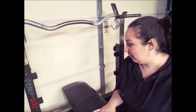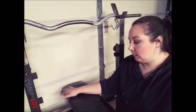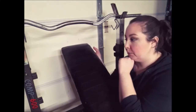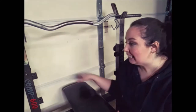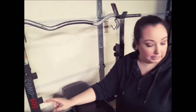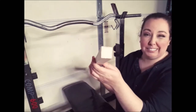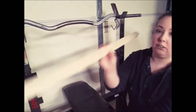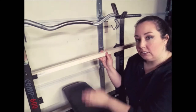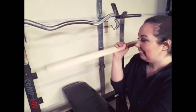Next up, the seat can be laid flat for a normal bench press or raised to two different heights for an incline bench press, but it's missing the metal bar that props it up. What I did was go to Home Depot and pick up a one-inch by one-inch square wooden dowel — it fits exactly right in the holes. All I'm going to do is cut this to length, spray paint it black, and you've got a brand new bar.